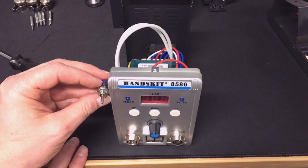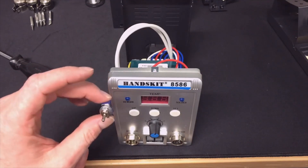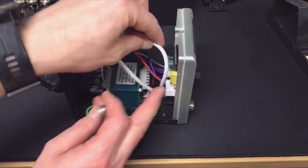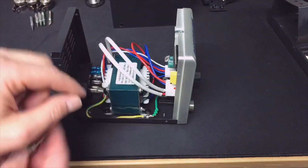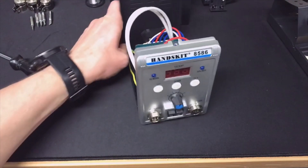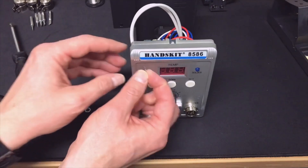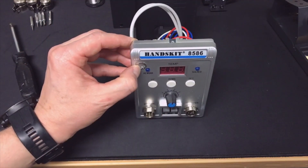It will not be one of my best modifications but I really don't like that it is in the back. The good thing is if I put it in the corner, the wire just fits like this - so if I cut it here I can just solder it immediately on the switch and I don't need anything extra. Just cut the wire, put some solder, shrink wrap, done. So we need to try to drill the hole exactly there, and I need the space of this ring to fit exactly there.